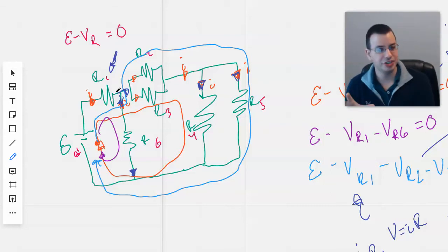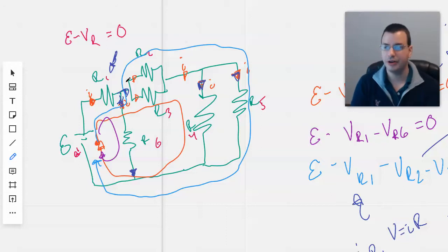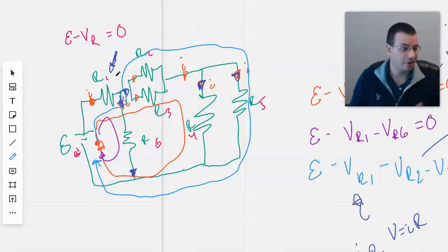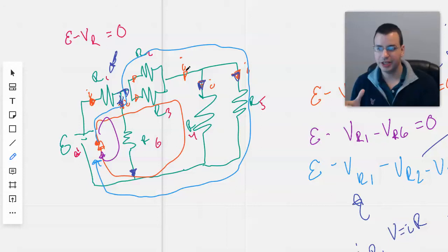The amount of resistance to flow is normally related to your volumetric flow rate, how much water is going through there, which is kind of related to current. So the pressure drop across each filter is related to how much water is flowing through, but also how difficult the filter is to get through. If you have a very fine filter or a very clogged and dirty filter, it's going to provide significant resistance. And then the water will flow through, and you're going to get a pressure drop.